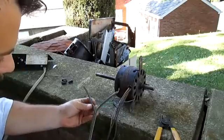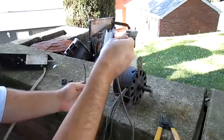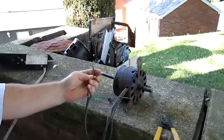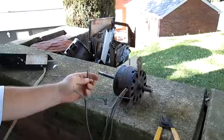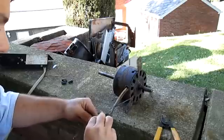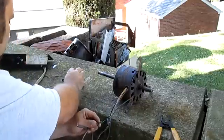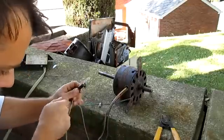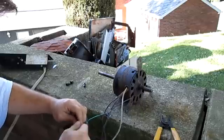On this particular cord, I usually try to keep the polarity correct. You can look at the end of the plug: neutral's on your left, hot's on your right, ground's on the bottom. This cord has a black stripe and a rib running down it, so we're going to hook that to the neutral line on the motor. We're using recycled wire nuts from that old high-pressure sodium light.